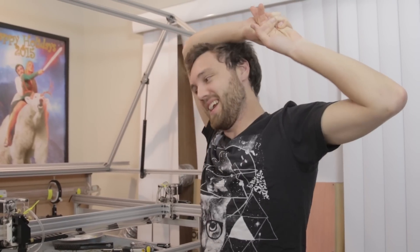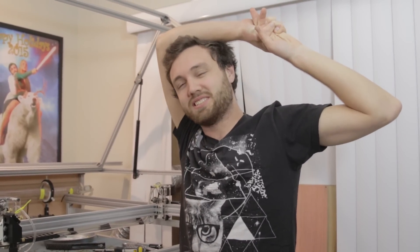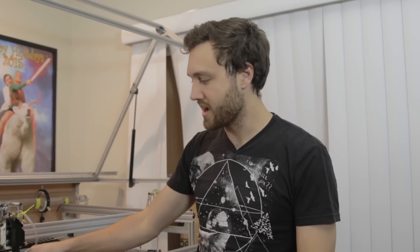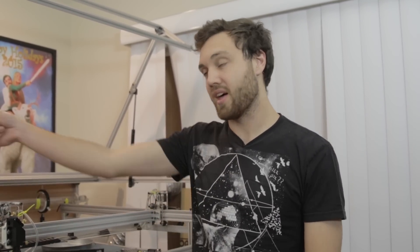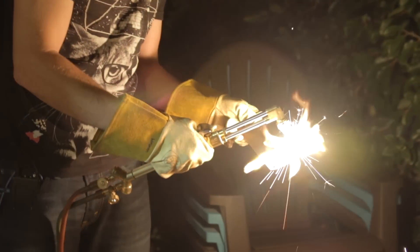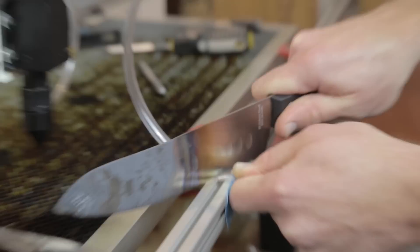So I don't think our tests are conclusive that heating it up actually helps or not. It didn't really seem to, but then again the big problem was just keeping the knife hot enough while trying to cut it — it cooled down so quickly. Let's just skip straight to the oxygen assist. The idea is we're going to take the oxygen tank and pipe that gas into the nozzle, which will spray out into the cut, and the oxygen will burn the metal. That's actually how a lot of cutting heads work. When the metal is hot enough and you dump oxygen onto it, it will react with the metal and burn it. The reason oxygen is so scary is because it makes things that don't normally burn, burn — and burn really well.